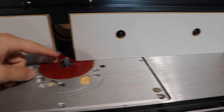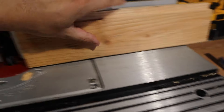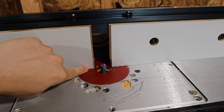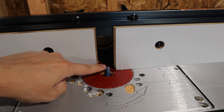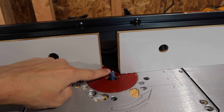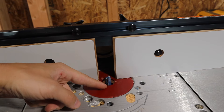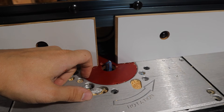Next up, we're going to cut the groove. Cutting the groove is a little different because it's going to be cutting right out of the middle. You want to make sure your fence is set to the correct depth so that when you take your pass with your piece of wood, it comes through and hits right at the very center of your workpiece. When measuring with the depth gauge, you have half the thickness of your bit included. Because you want this bit centered, you need to take half of your overall workpiece thickness and add half the thickness of your bit. For me, three quarters of an inch back puts me right at center, but measuring from this side of the bit, I need to add a quarter inch because it's a half inch bit — measuring a total of one inch from my fence to this side of the bit. Just be careful, because it's really easy to be off by a half bit width, or more correctly, a bit radius.